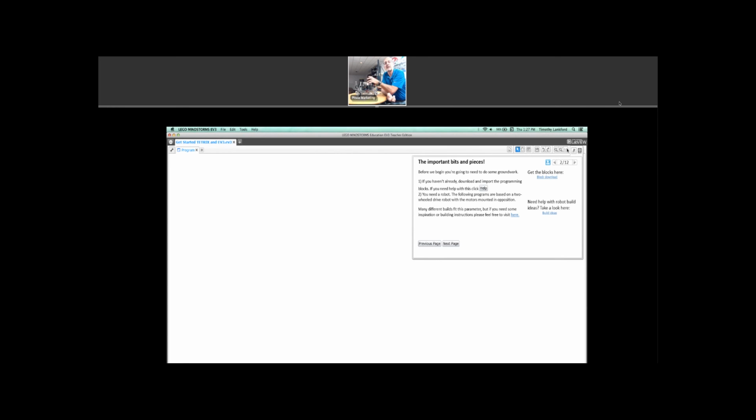The EV3 has what we call an auto ID feature that will know intuitively what sensor is plugged in the sensor ports. But when I have a third-party sensor, if I'm not giving the right information back to the EV3, then it doesn't know what that sensor is. Part of being able to send the right information back is dependent on whether or not these boxes have power. So it's a good idea to power on the TETRIX portion before you power up your EV3 brick. I did that with a little bit of delay, so we'll look here in a minute and make sure that it sees the HiTechnic control boxes correctly.